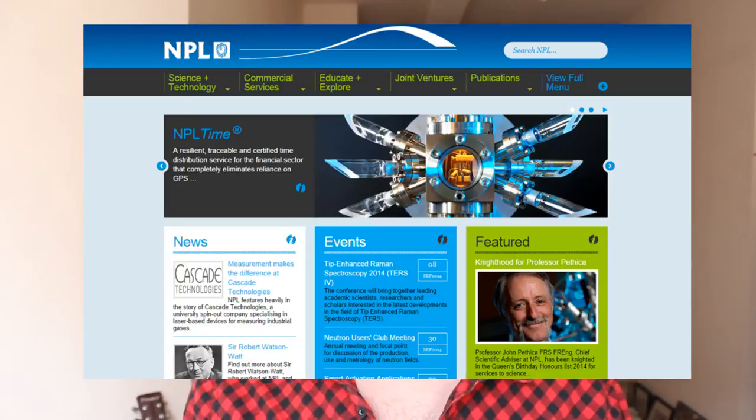It's just a radio receiver — it works at 60kHz and it receives signals from the antenna. It then goes into the interrupt on the Arduino and it measures the high and low signals that come out of it. There's a whole bunch of information you can find on the NPL website — they're the people that broadcast the signal — to tell you how to decode that.